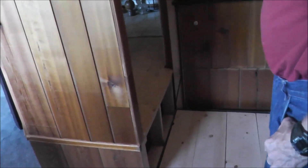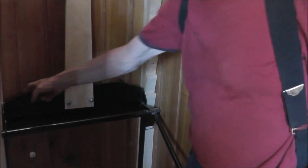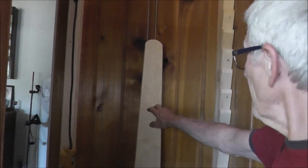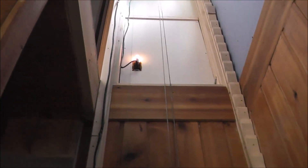This is where the elevator is. It's just a steel platform with angle iron, and it goes into a groove along here and a groove over here — that's the guide to make it go up. I've got a brace over here so you can stand on it and it's quite strong. This piece is bolted on here and it goes up; when it gets to the top it'll hit the switch up there and shut it off on the second floor.